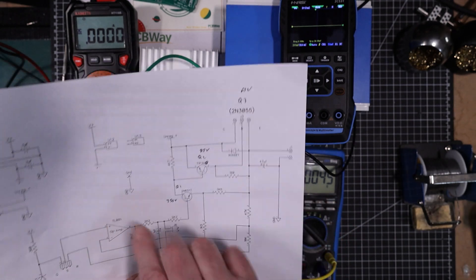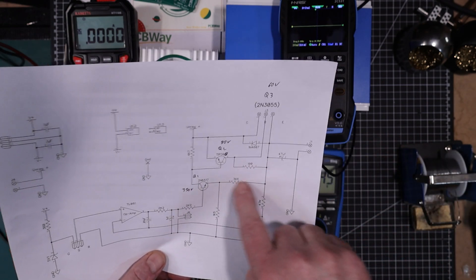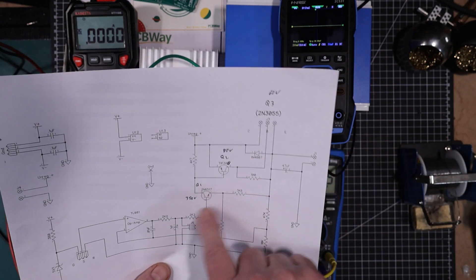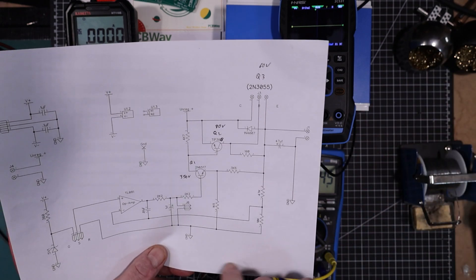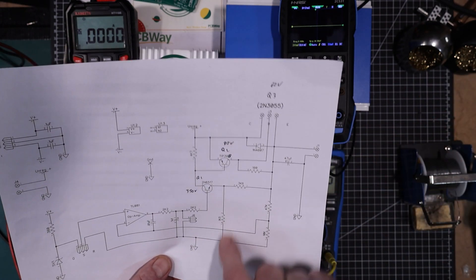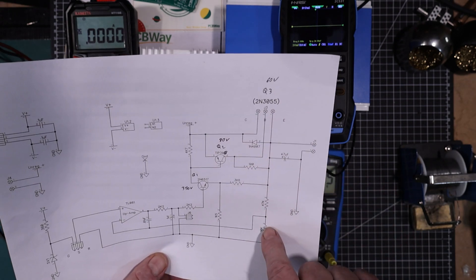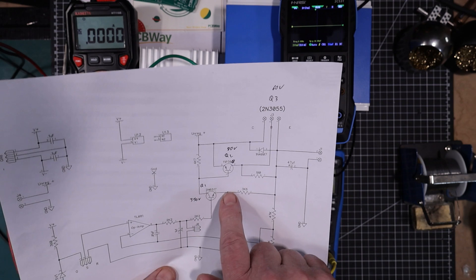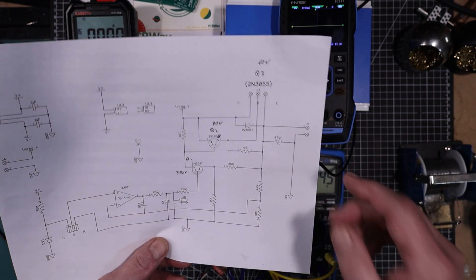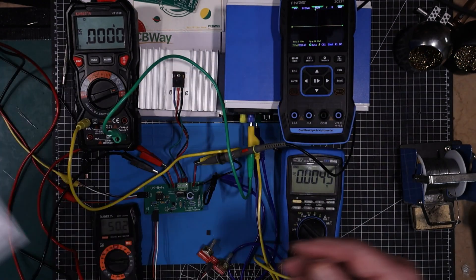The other feedback is the overall feedback that gives us the gain, so that we know what voltage we're going to expect out given a reference. Now we have another feedback coming down through here. This transistor has quite a bit of gain — the specs say 20 to 300 depending on conditions, so let's guess around 100 — and that, the way it's configured, will be voltage gain, so it could possibly be unstable. It does have an emitter resistor which will provide some negative feedback with respect to current into the base, but it won't monitor the output at all. That's why I have this resistor going back in to provide additional negative feedback from the output, so if it tends to oscillate it'll reduce the gain further and damp out the oscillations. That's the theory anyway. I'm ready to start turning it up.